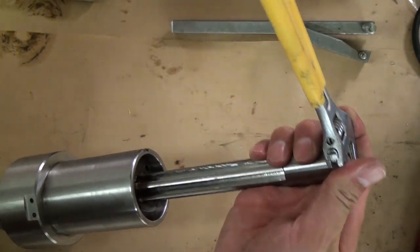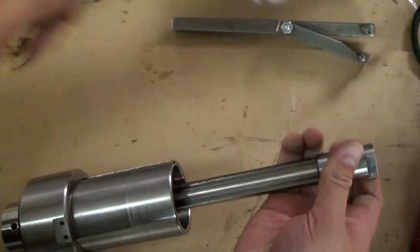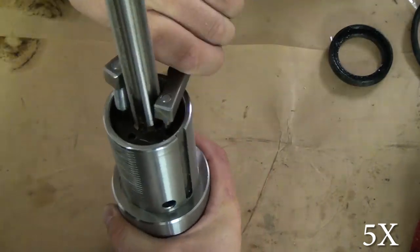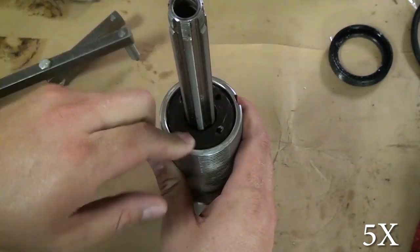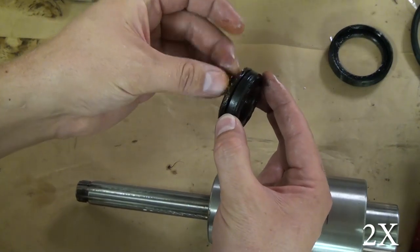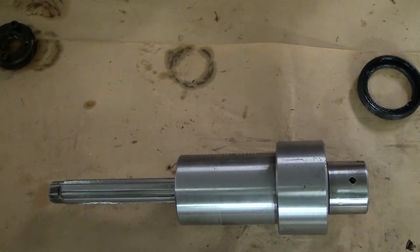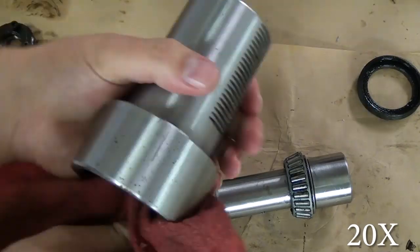On to the spindle rebuild — this video is all about bearings and spacers. The first thing you saw me do was using a pin spanner to remove the upper preload nut and the bottom nut. You're going to have to build a pin spanner or own one to get this job done, because I tried everything I could think of and could not find a way to remove these two nuts from the quill. There is a link to a drawing in the description with all the dimensions of my pin spanner in case you want to make your own.